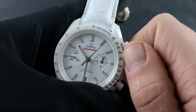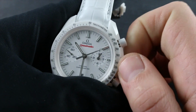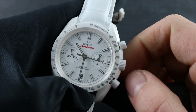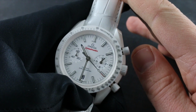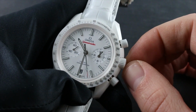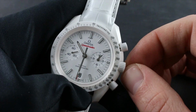But if you are determined to wind the watch to its maximum rated power reserve of approximately 60 hours, simply continue turning the crown in a clockwise direction. Because of the bridle style mainspring, which slips to relieve any excess strain, you cannot accidentally overwind this timepiece. So simply listen for the click or tick from within the case that is the bridle slipping. Because you can't overwind it, that is both safe and your sign that the watch is fully wound.